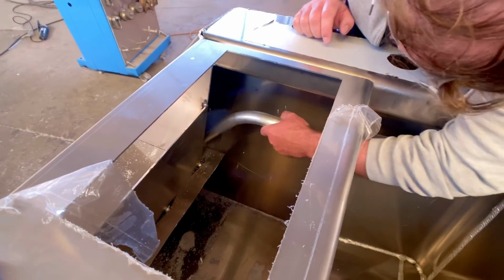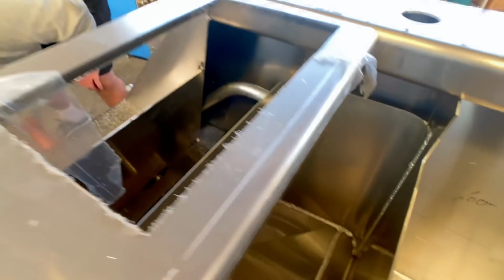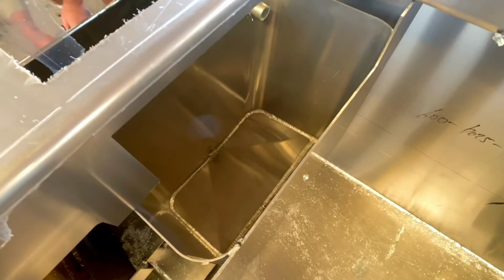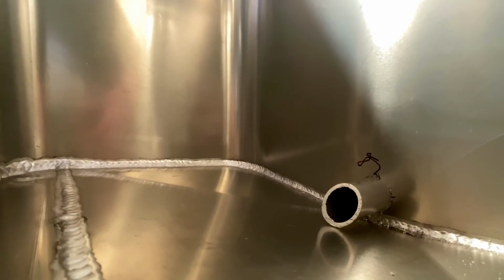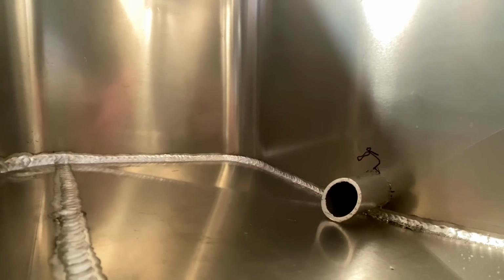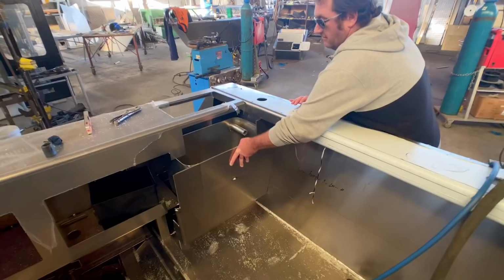Dane is a man after my own heart when it comes to building a live bait tank. He is already building all of his live bait tanks with a false bottom, making it super easy to get fall in the bottom of the tank so that all the water drains out of the tank when it's sitting there doing nothing. All internal corners of the tank are curved, therefore no live baits are getting caught in the corner, going belly up and not being live baits anymore.